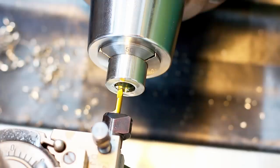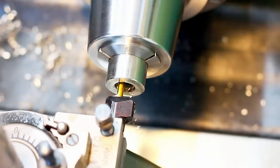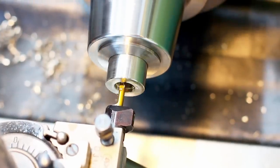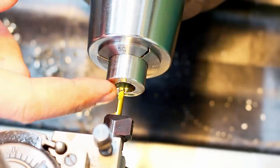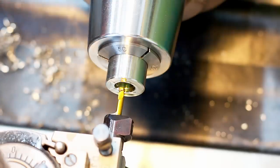This is, of course, a high concentration operation. You can't do this on the fly. You have to be at least medium focused. If your machine is half decent quiet, you can also hear once the cutter reaches the thread relief, and then immediately you let go of the spindle drive.